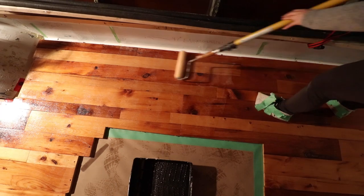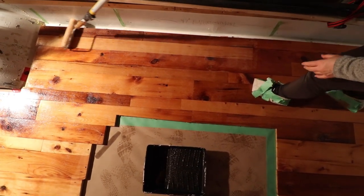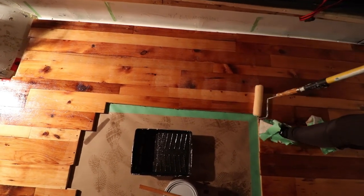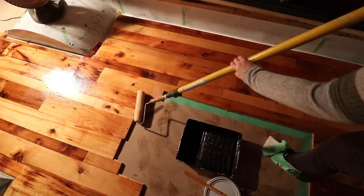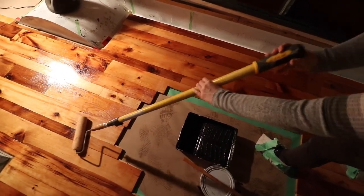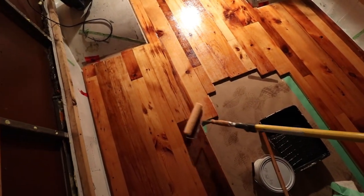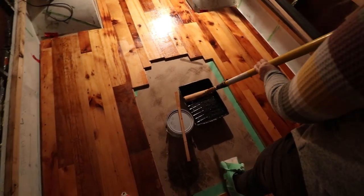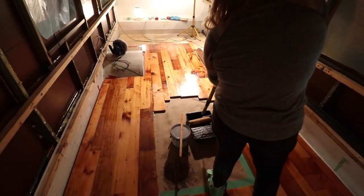I definitely see why WOCA suggested using a tighter nap. I think when we rub it in with the polisher, it'll help smooth out that loose nap look. I think the bigger the nap, the more oil it will hold at one particular time. I've only re-dipped once so far. It's doing good, there's good coverage. Let's try to wring it out a little bit better.